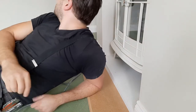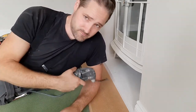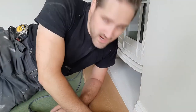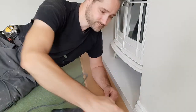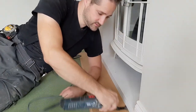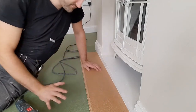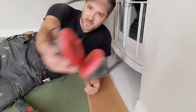This is a tool — I'm not going to lie to you, it's not the fastest tool. What I'm going to do is mark the underside — most importantly the underside, not the top side; I cannot stress that enough. So with the underside facing up, get that going on there, cut it all off, remove the off-cut — boom — slide in perfectly. Put on your ear defenders.